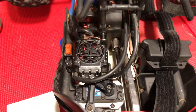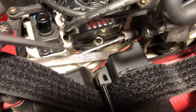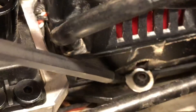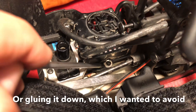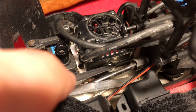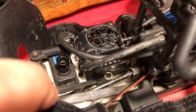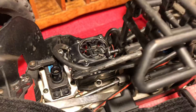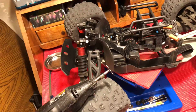So I kind of had to create my own MacGyver mod to fix it, because the actual plastic housing that this screw went through broke completely. The only way to fix it without buying a new ESC was to do what I did. I actually took my Dremel and dug a slit into the plastic — the bottom section of the ESC is plastic and it's thick enough to accommodate a thin Dremel bit — and I put a pretty deep wedge into the plastic.